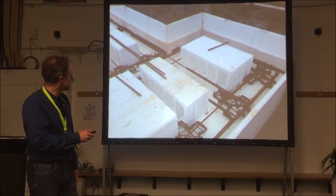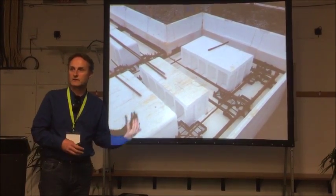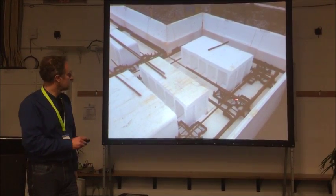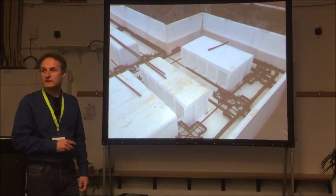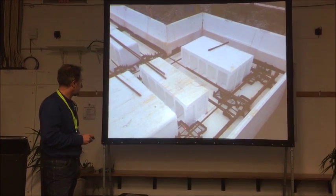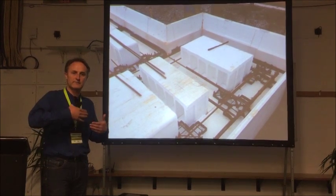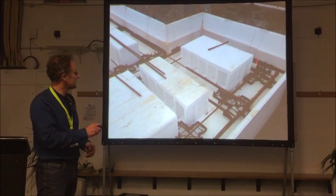These pods here are not there for insulation. Some people see them going in around town and think it's going to be warm because there's lots of polystyrene — they do nothing. Remember, 80% of the heat is lost out the edge. The pods are there to form beams, to create an enhanced slab and make the floor stronger. The important part is the edge.